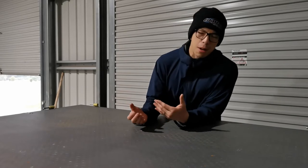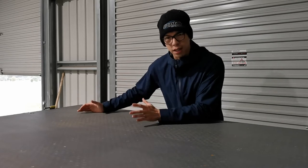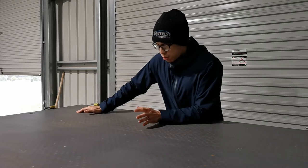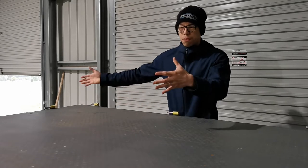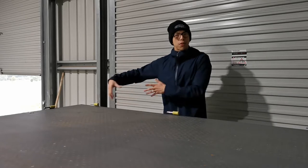You can have some that is permanently attached onto the canopy, but that requires quite a fair bit of engineering, because you need the aluminium part to be thick enough to hold the spare wheel, or alternatively you can use steel, but then they'll just add on some weight. But for me, because the canopy is not a full size canopy, I've got this amount of space in back, I do not really want to have the spare wheel hanging around here, just taking the space. So what I want to do really is to build a spare wheel carrier that is obviously removable, and also is a swing arm from the canopy, so I can still access this amount of space.